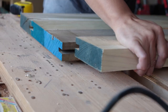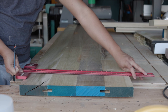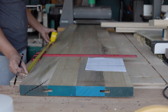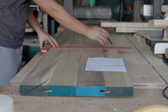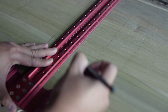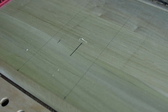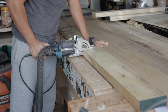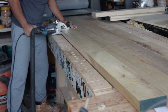To connect my rails and stiles I'll use my domino. The critical piece was the rail in the middle that divided the space for both glass panels — it had to be perfectly centered so that each panel would be exactly the same size. I also had to make sure that the location was the same on both doors; if I didn't get this location near perfect on both doors, the rails would not be aligned when installed on the track and stacked together.